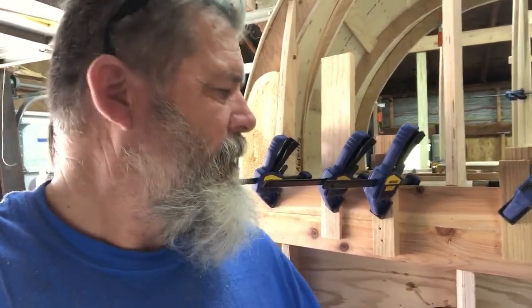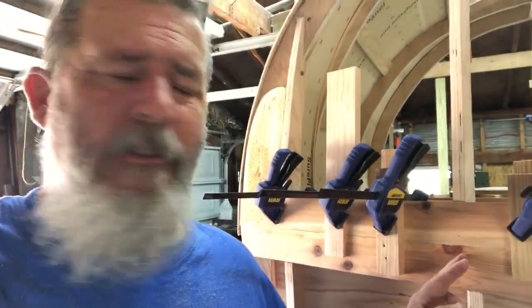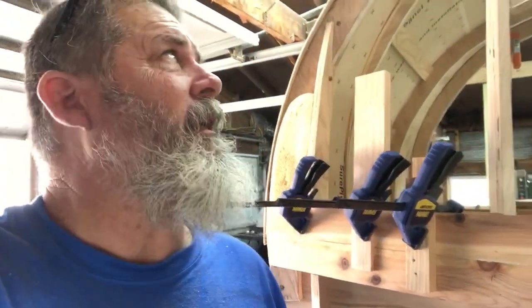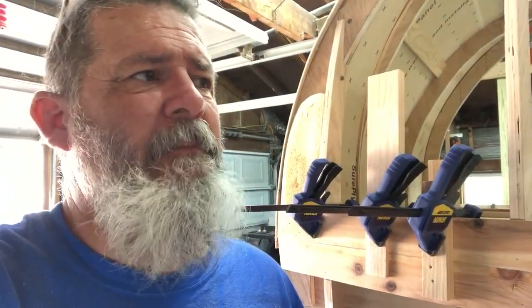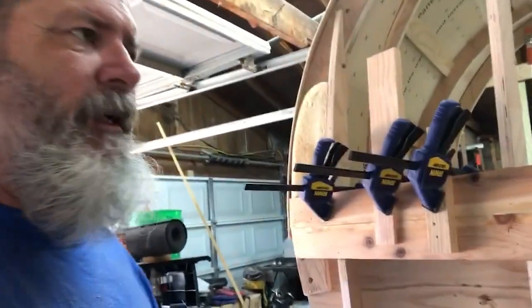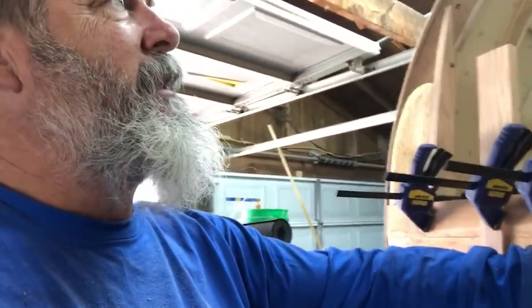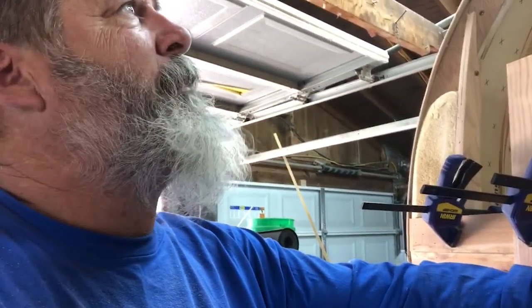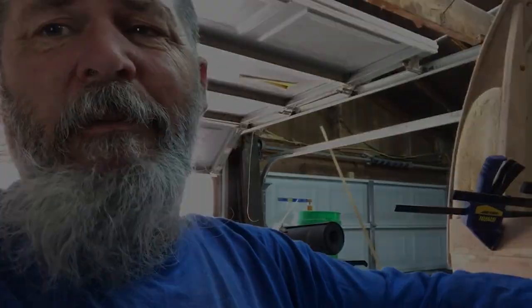As you can see, one of those boards covers two widths. That's about 5 inches. I think it's about 40 inches from here to the top. The nice thing about cutting these boards in half and then planing them down is that these boards end up being as long as they are. Each one of these segments is only half a board. So I end up not getting 4 boards, but 8 out of this. And so I think it's about 16 boards to the top. Anyway, we'll see what it looks like when I'm done.